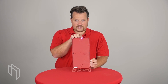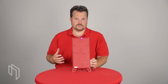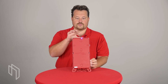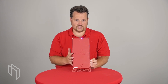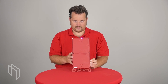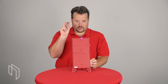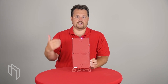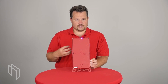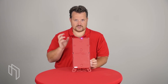The other LED, the blue LED, indicates whether the reader is operating or not. When the blue LED is off, the reader is not reading. When the blue LED is on, the reader is reading. If the blue LED is flickering, the reader is actually seeing chips in range — so you can tell whether it's picking up a chip by watching the blue LED flicker.